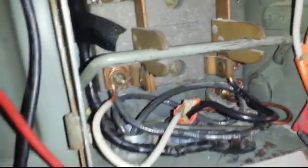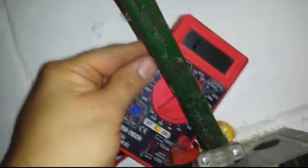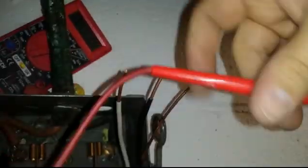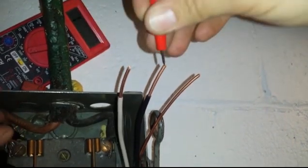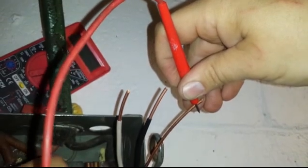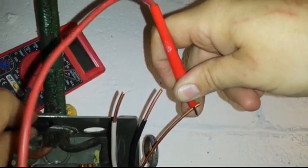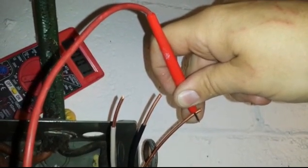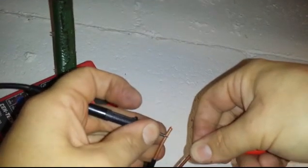I've got all the wires attached here and I've stripped the wires on the other end of the 10 gauge. So I'm going to do a continuity test — I've got my multimeter here. We're just going to make sure that we are actually connected everywhere where we're supposed to be. That's good, that's good, that's good — yes, I'm holding the phone with my mouth — and that's good. We want to make sure that the ground wire just goes to the box. What I don't want is for there to be a short from this lead to this lead — no shorts. No short to ground there, no short to ground there.